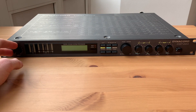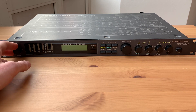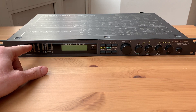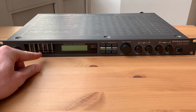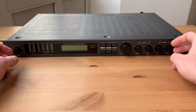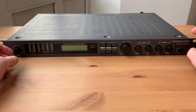On the front side of the DSP: on the left there's an analog level adjustment before the ADC for setting the input level, then level meters for the two inputs with a clip LED, level meters for the four outputs, LEDs showing if limiters are active, a rotary encoder for menu control, and analog level adjustments behind the DACs. Now let's switch it on.